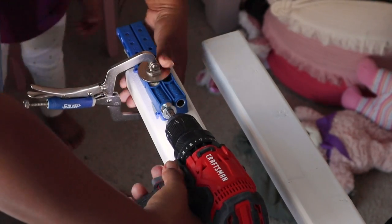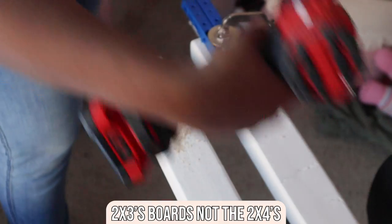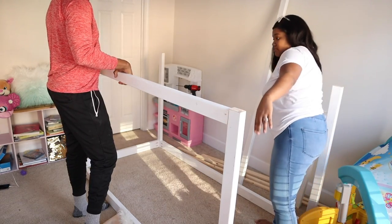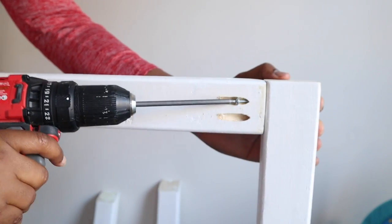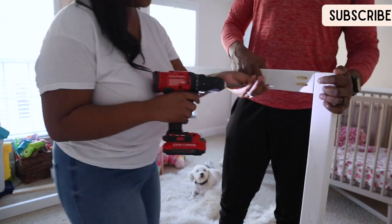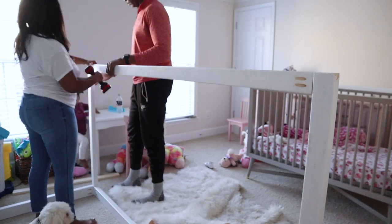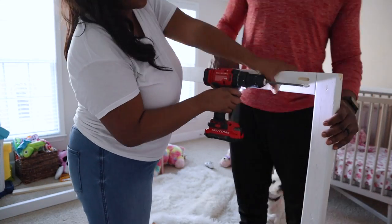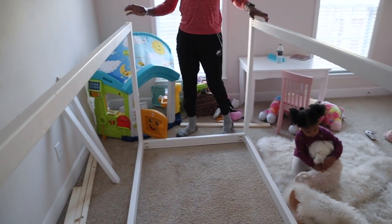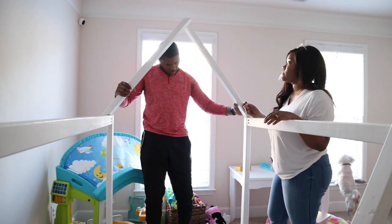After we got our angle situation fixed, I'm adding pocket holes to the two by fours cut at 76 and three-fourth inches and adding that piece horizontally to the top on both sides. This two by three at 76 and three-fourth inches matches up exactly with your bed frame — the two by four also at 76 and three-fourth inches — as the side piece. The front and back pieces are the two by fours at 38 and three-fourth inches. Now we're going to start working on the top of the house bed — the part that creates the triangle.